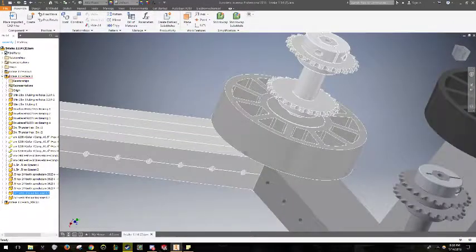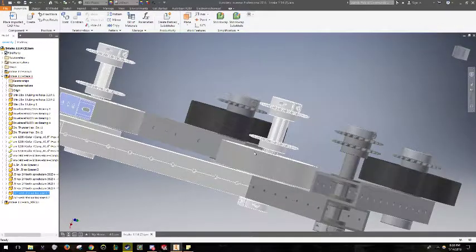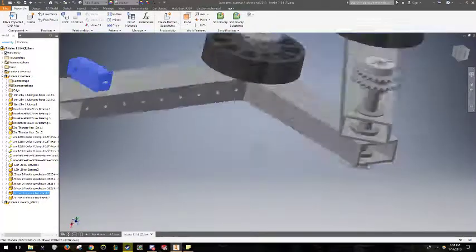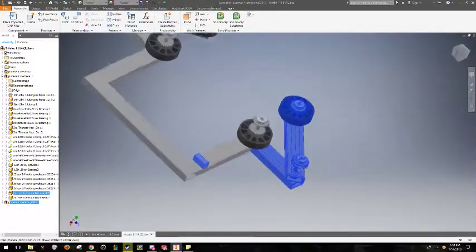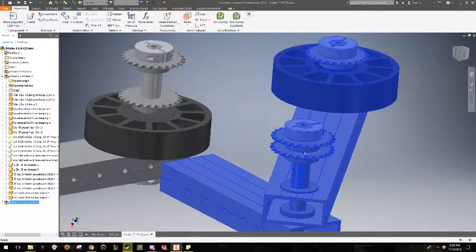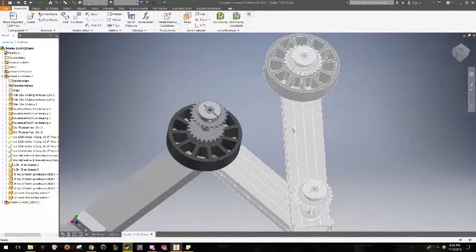The other thing with this is we have some wheels up here that are going to be powered by a sprocket of some kind. So you have compliant wheels, and then we have a shaft going through them. This is fixed to this other piece here, which is connected by the same bracket. In addition to this, we also have another set of sprockets, which are connected to a dead axle here, and this dead axle allows this part to spin freely.